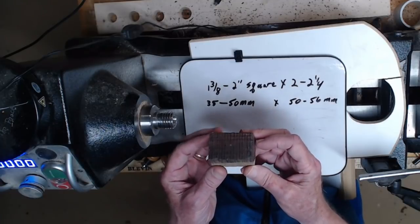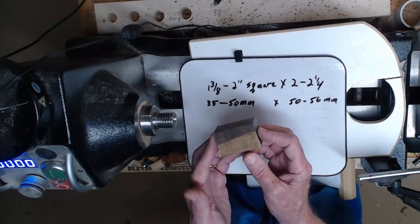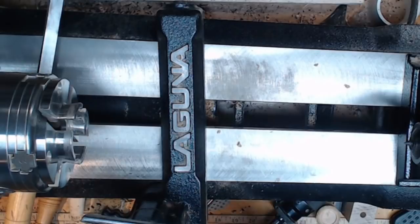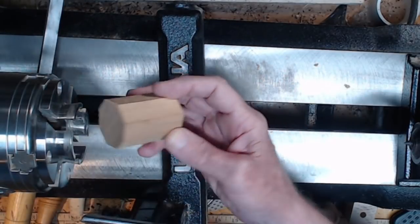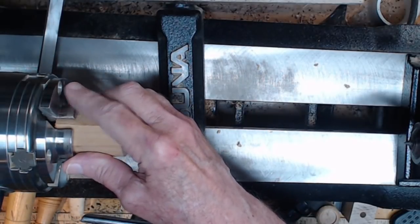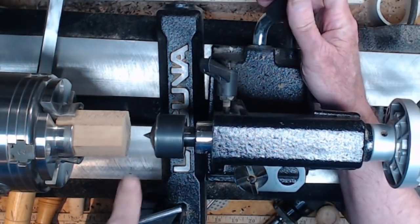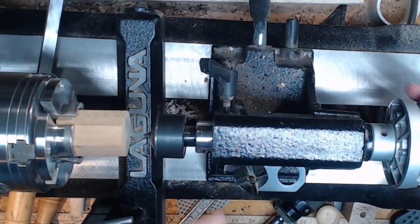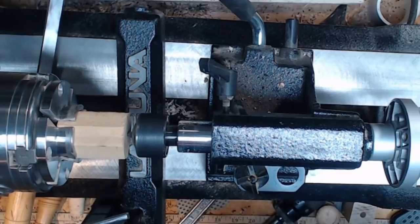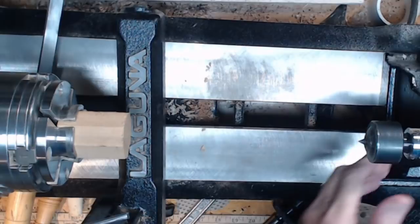One of the reasons these blanks don't have to be too long is you don't want your bottle stopper too tall. If they're too tall, they won't fit in a refrigerator, but it all depends on your design. We're going to use a piece of maple cut octagonal. I'm using these 35 millimeter jaws, just snugging it up and bringing up the tailstock to center it, using a piece of very dry maple.